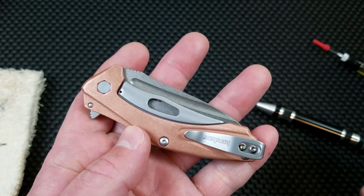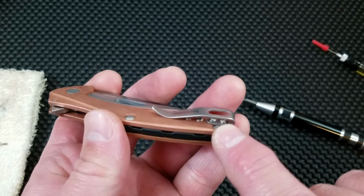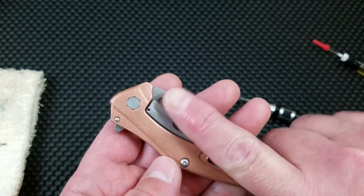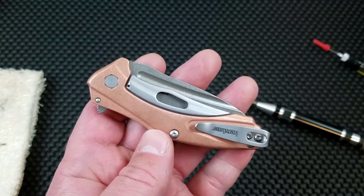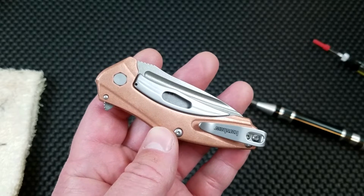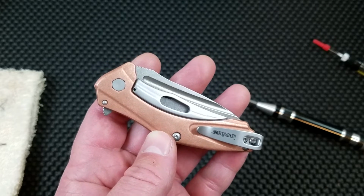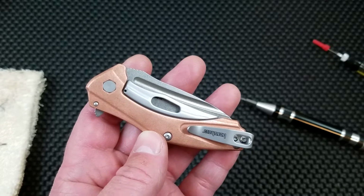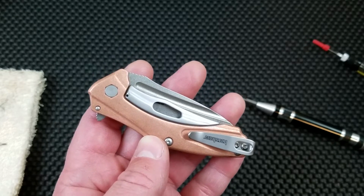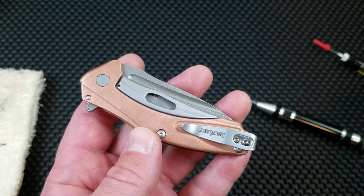This knife absolutely needs not only the mounting screws, but it also needs these two pocket clip screws as locating pins to keep this lock bar from having lateral movement. And the way that lock geometry works with the detent ball and the detent hole, they're not really centered up. The detent ball should fall fully into the detent hole, but be on the leading edge of the detent hole and not centered. And it's very, very much a precise measurement, guys. To get a good detent, that's the way it's got to be set up.